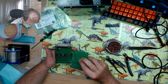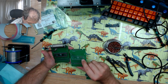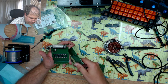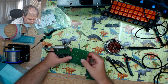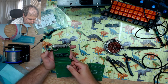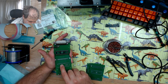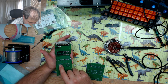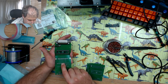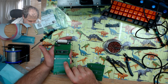So I've got one all the way down until just before the U1, which is on there, as well as the middle one at the back, because that's the ground. Then looking at it from the underside, you can see that from the second one in, the first 7 have pins, then there's a break, then the next 4 have pins.